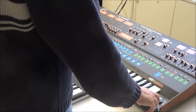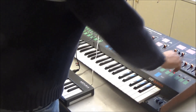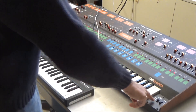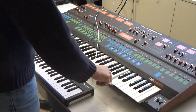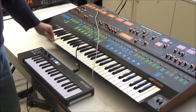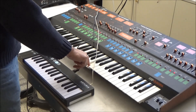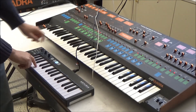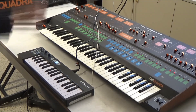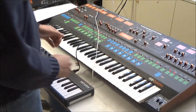Just the same as if you're playing the keybed. And then finally the lead synthesizer. Here's the cool part — let's turn the cutoff frequency down so you can hear this. Now we'll turn on the volume and brilliance aftertouch effects. So that's through the keybed, and here I have no aftertouch because I'm off the touch sensor which ends here — but here I have it. And so now I'm getting aftertouch off the top three octaves.